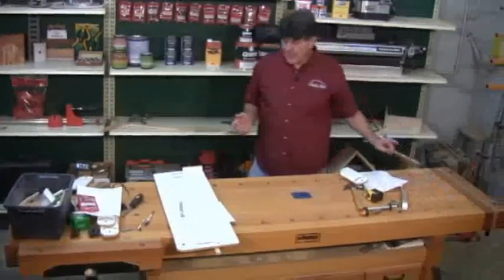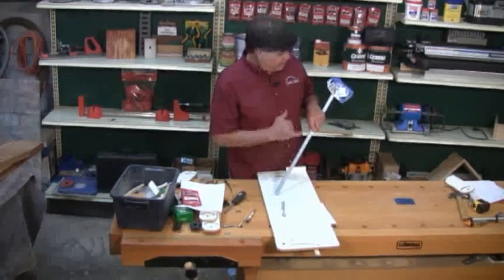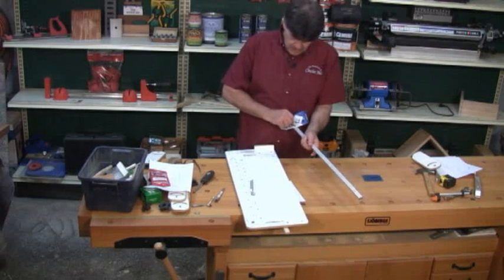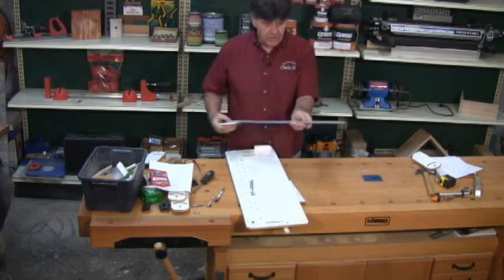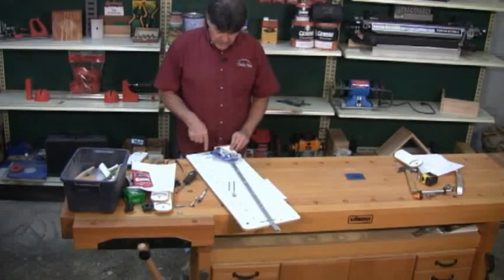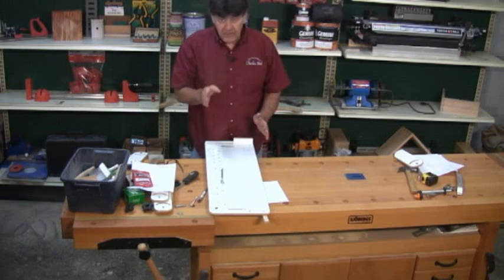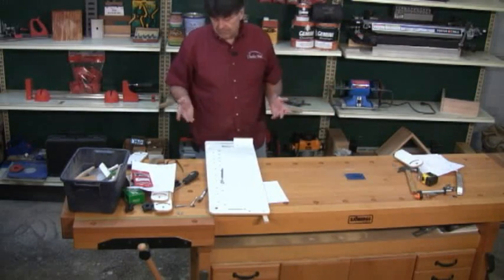A nice alternative is to use a nice metal slide. If you're going to do that, now you see this has got a hole and it's countersunk. They also have the little nylon inserts that you can put in here to help adjust and keep it nice and tight in your miter slide. What we did, when we did ours, is just like they packaged it. They've got a hole drilled. I just drilled another one, and what I did was take a small bolt, run it up through it, and put a wing nut on it, so that I could set this where I wanted with that wing nut, and I could adjust my jig to my slide and get everything accurate. You want to make sure that if it's touching here and touching here when you run it. Pretty much that simple.